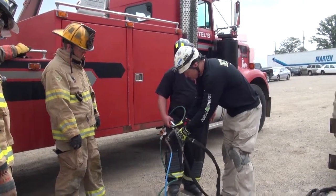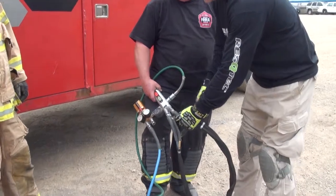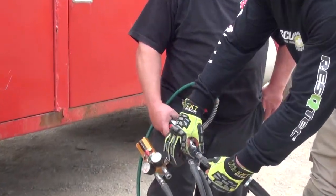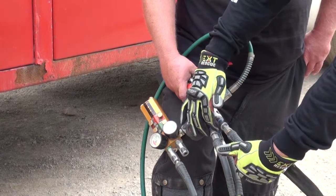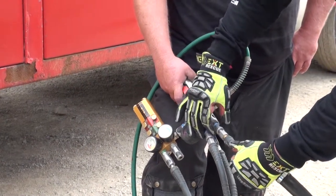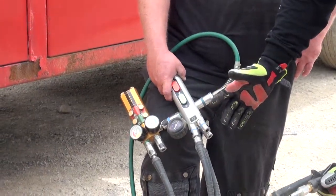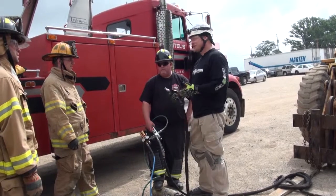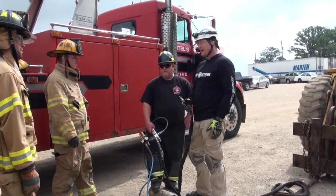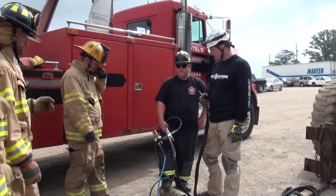If I were to plug this in, it's just a push — locks in place, even though you hear two clicks. When I want to take this out, I've got to push this black button and it's going to come back one stage. I can't be pulling on it when I go to hit it again — I just relax, hit it again, and it pops right out. If you've connected everything and you're not getting pneumatics where you want them, you probably have not fully seated one of the couplings. That's one of the first troubleshooting applications.